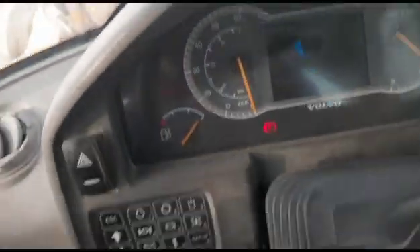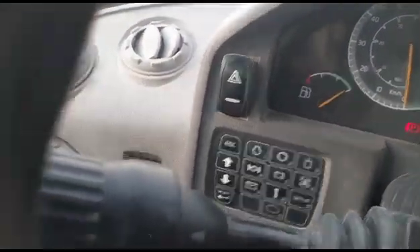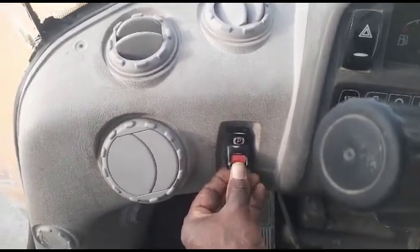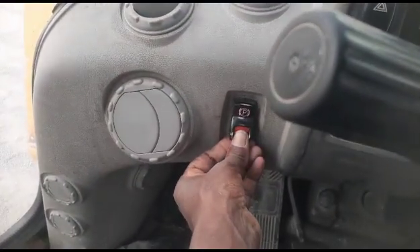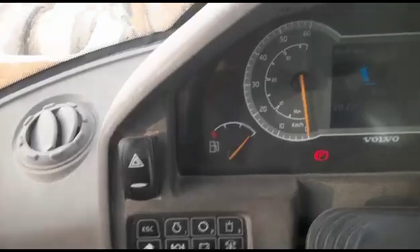So I removed that — you can see I try to remove its parking brake. You can see it's not removing; I push the other side but the parking brake is still there. First of all, I will check if the parking brake solenoid is working or not. This one is my parking brake solenoid, and this one is a directional valve downside.